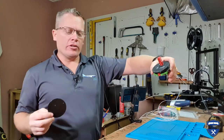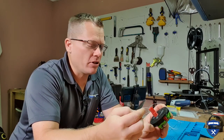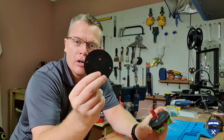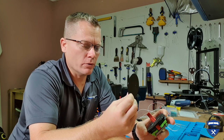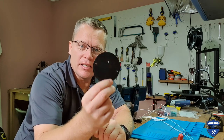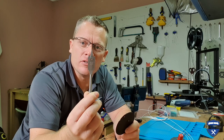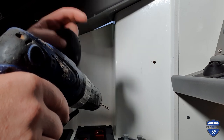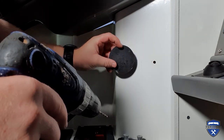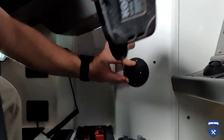There's one bit I haven't shown you: in the 3D file, if you download these plans, is the drill plate guide. This is the exact same dimensions as the base plate - it's got three 4mm holes at the exact centers of where they need to be drilled into the sidewall. The center shaft is there for the pilot hole, which is the center for the 18mm spade bit I'm about to use to drill the big hole for the shaft. Let's head inside and see how it goes. Here we are inside the cockpit at the captain's sidewall. I'm going to place the drill guide into position and pilot drill the three holes.